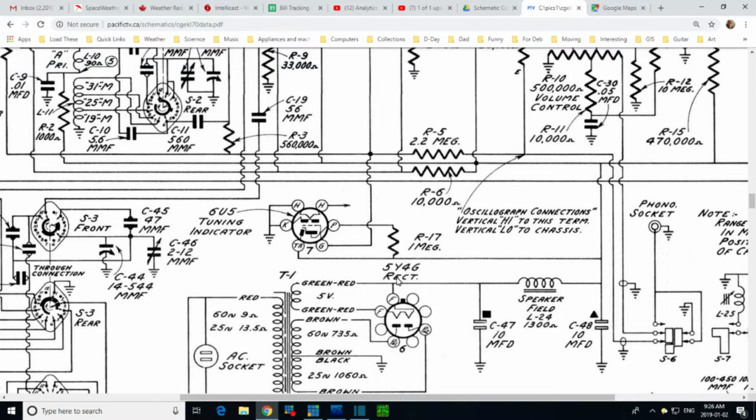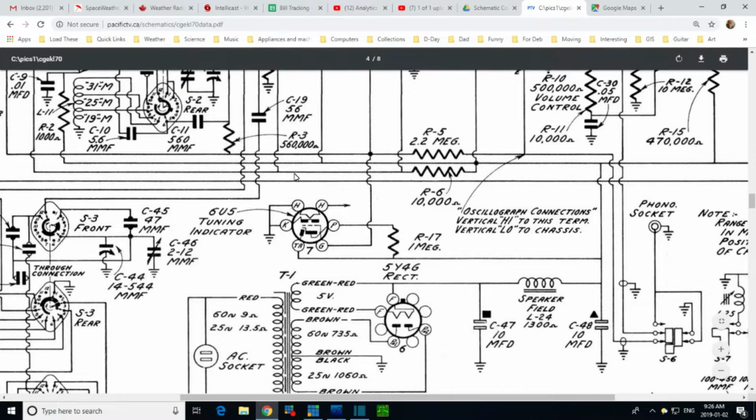Now, they don't have to be up here, they can be back in the radio. They're up here because often these magic eyes are like an add-in unit on a radio. It's almost like adding a voltmeter to a radio. Build the whole radio, get the whole thing working, everything's great. Oh, let's stick a voltmeter on the AVC. Okay, stick it on there. What the heck? That's what this is like.